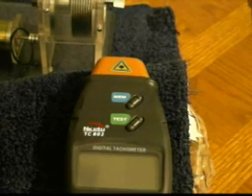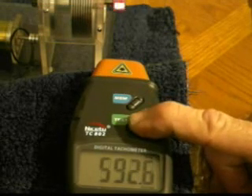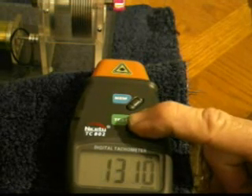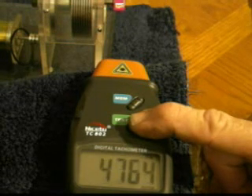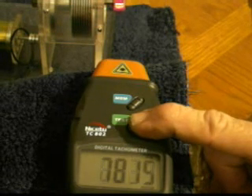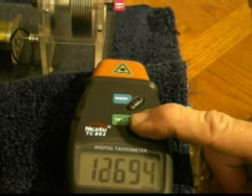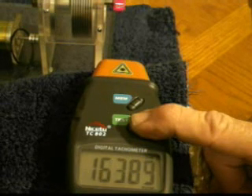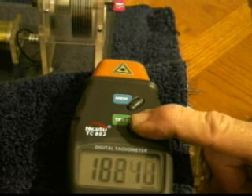I'm going to put a little tachometer on it. I've unhooked the generator, running at about 20 PSI. I don't want to go too fast because it's only got an acrylic housing, which is not the strongest stuff in the world — it could blow up and send discs running everywhere. It's about 19,000 RPM.